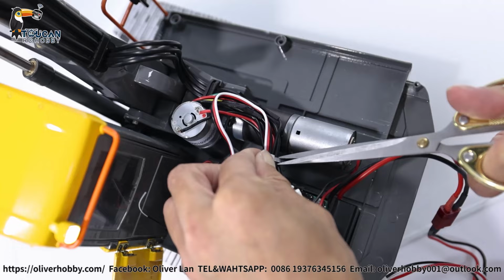Take it out. Then turning to this side. So here that's the rear driver. Then at the right side of upper part, here still have screws here. So remove it out, one here, take it out. So all the screws take out, then we can remove top cover. So all have 8 screws from bottom take out. Now we can remove the top cover.